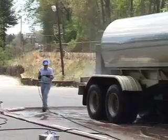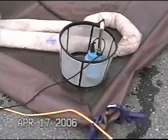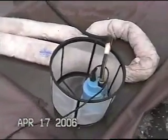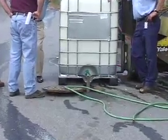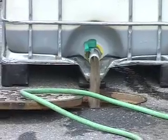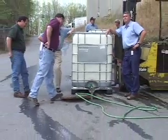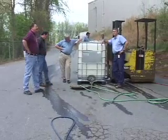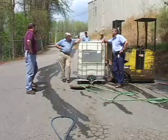Remember that the milk scum is water-soluble. On the pad in the bottom right-hand corner you have a strainer with the sump pump set into it, and in front of that is an oil-absorbent boom to pick up any hydrocarbons coming off the tanker. Those booms can be reused again and again — the oil can be squeezed out. There's the tote the sump pump pumped into, which is being discharged to the storm drain after being neutralized. Chemists on site brought ingredients to neutralize the sanitizer before it was dumped to the storm drain, and we also had storm drain inspectors there.